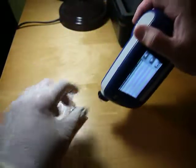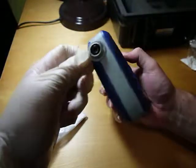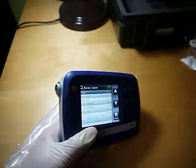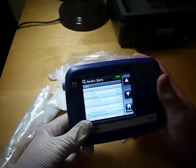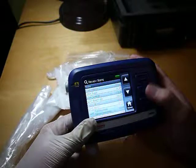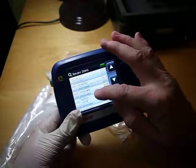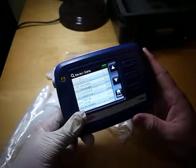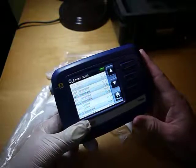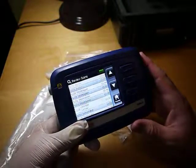This is in bags, but you can actually test the raw chemical. If you get powder or dust or dirt on the lens, you can just use an alcohol wipe to wipe it off. That's testing all these powders. Again, these are all in the library of this instrument — if they're not in the library, it's not going to identify it. There are some results that are inconclusive; it may be getting a reading but doesn't have it in the library, so it won't guess — it's just comparing waveforms. I would look at the library and see if the drugs you're interested in detecting are in that library or not.